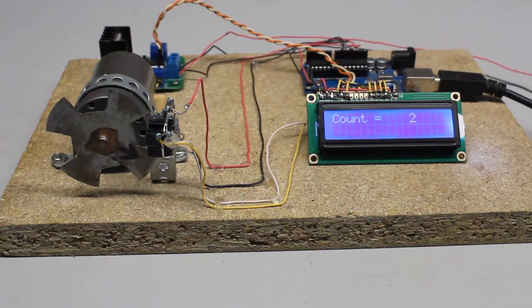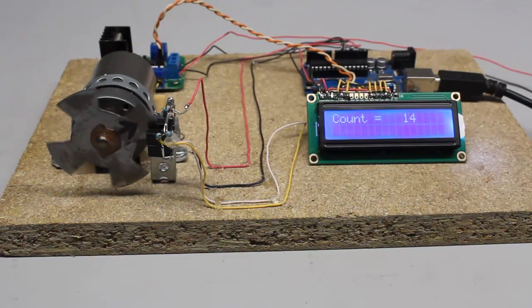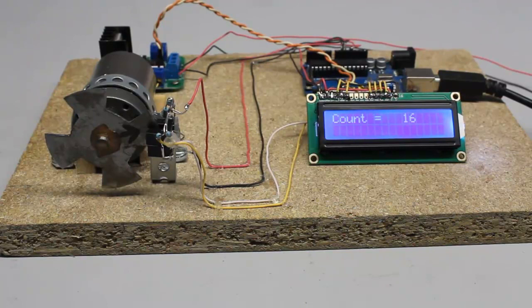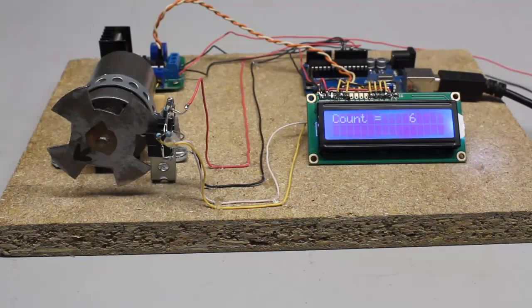As you can see, the rotation is not divided into equal steps. That's caused by the fact that teeth and gaps of the sensor disk are larger than the distance between the two phototransistors. After 16 steps, the motor has done a 360-degree turn. The direction of rotation can be changed by software. With the microcontroller and the sensor disk, the DC motor operates as a stepper motor.